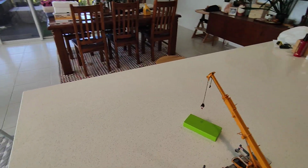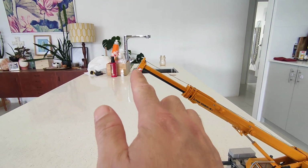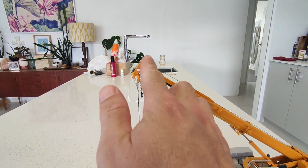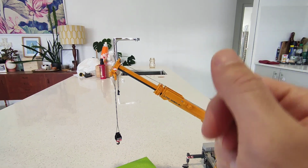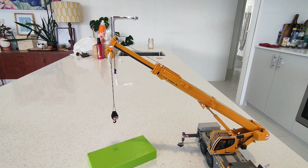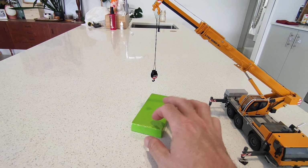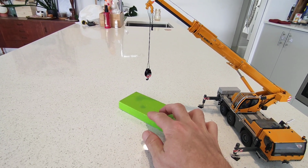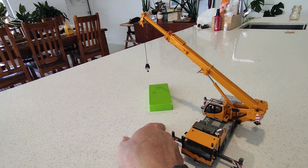It's 90 degrees from the boom. 90 degrees from the boom means you should see the flat part of the tip, side onto the tip, side onto the boom. That's 90 degrees. Pick your side, bruv. Any side is 90 degrees, alright? Do not go centre of load. Like I've said 6 times now, centre of load is over here. Pretty much picking his slew.